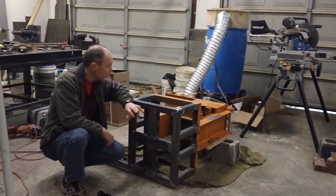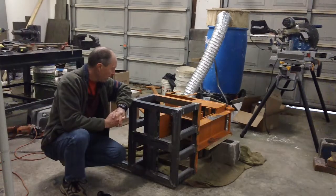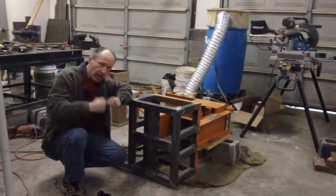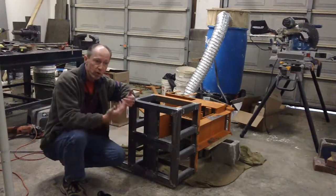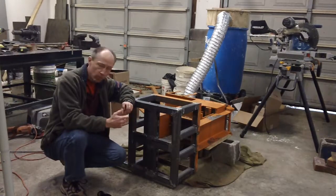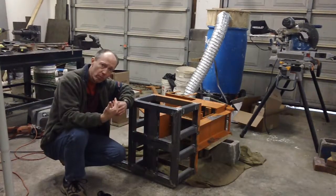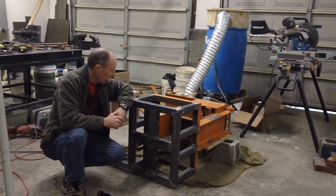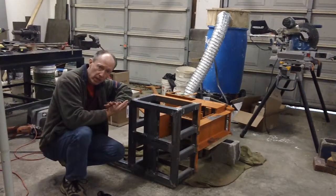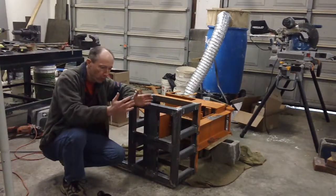You need about 15 tons to compress this thing. When I first got it, I experimented with making some brick and started with a really dry mix. It's very hard to compress a dry mix and it took everything I had, then I couldn't eject the brick from the mold — I had to dig them out. I tried again with less fill and was able to pop the brick out but they crumbled because they weren't compressed enough. Adding more moisture makes it amazingly easy to compress, but then the bricks were too soft and would crumble before you could even stack them.